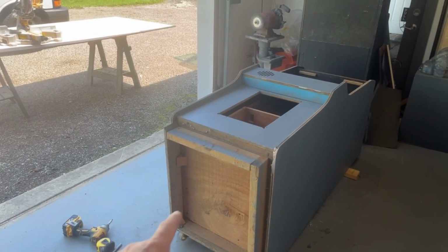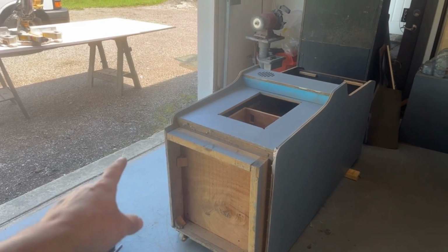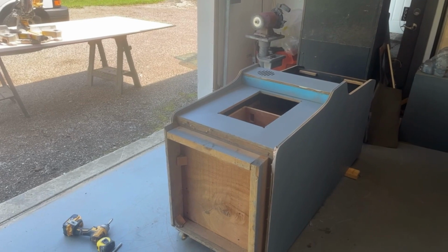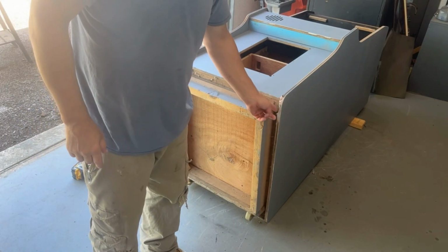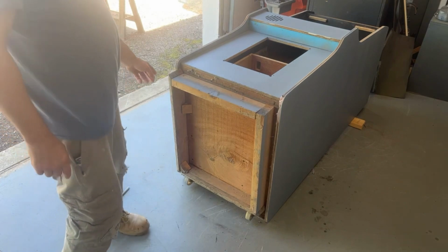First thing I want to do is get this wood base taken off of here. Somebody had made two sides of it out of 2x4s, and the other two sides are the pine that they originally used. So we're going to knock these off of here, and then I want to fix this corner and get it bondoed in and get my groove and everything back for the T-molding.